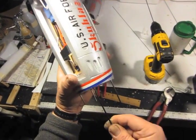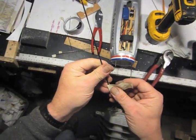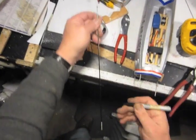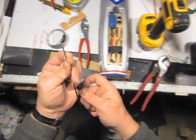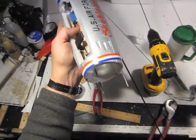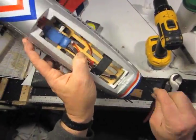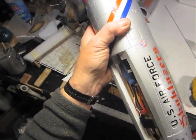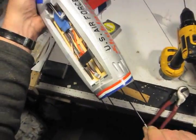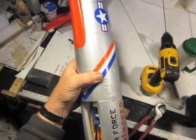Have the chisel tip facing the outside, or better yet, mark it so that you can twirl the rod as you put it in. So we put a little piece of tape on there, and then we mark it with the chisel tip facing me. So that's my chisel tip side. So now I can twirl the rod inside there as I install it to get it moving if I need to, like this. There we are. Okay, so I'm at the 12-inch mark, I think. Yep. Alright, so now I face my chisel tip out like that, and whoosh.